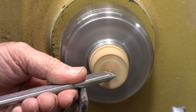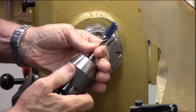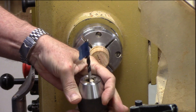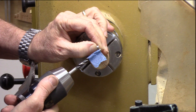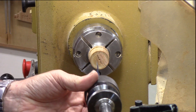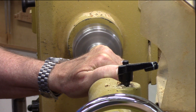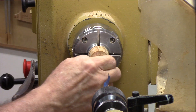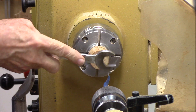Now I want to make just a little divot, and the first thing I'm going to do is drill that out. I like to use a brad point for these holes because I want a nice flat hole. I put the drill inside my Jacobs chuck so I can look at it and make sure it's actually in the middle. I put a little piece of tape because I don't want to over-drill the depth. I'd like this rare earth magnet to be just a hair proud of the wood — no more than a thousandth. I'll just let it find its center.